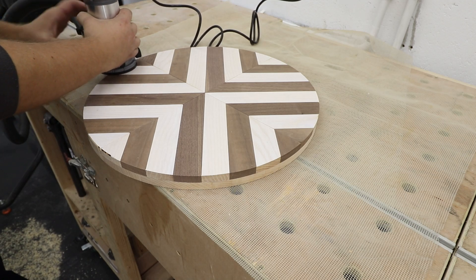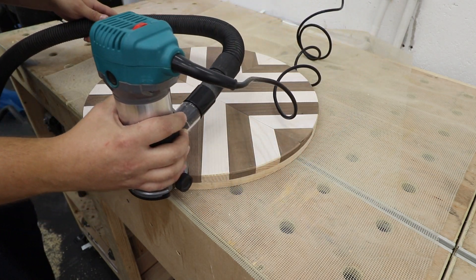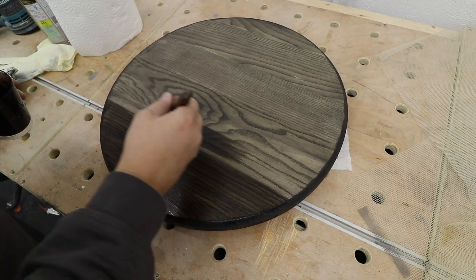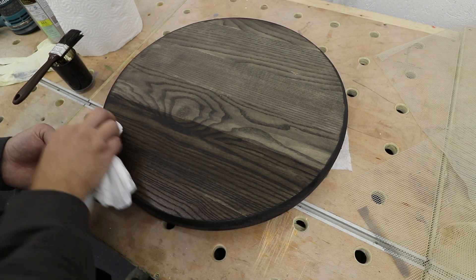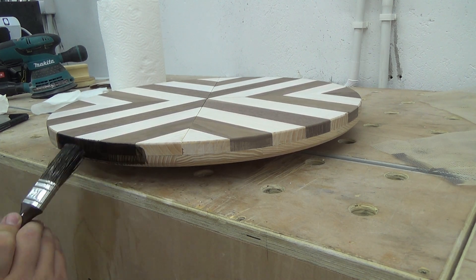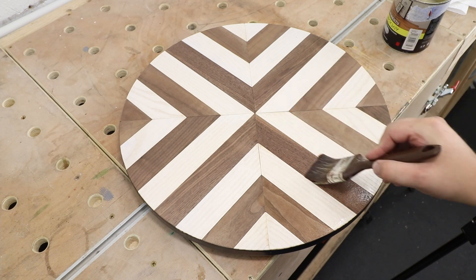On top of the tabletop I'm using a really tiny roundover bit — not much at all, just to get rid of the hard edge. On the bottom though I'm adding a chamfer to give it a really interesting and nice look. For the base and the edges of the tabletop, I'm applying the same wenge wood stain — more or less black — which I think gives a very interesting contrast with the white chevrons on top. I've already applied one coat of varnish on the top, denibbed it by hand, and now I'm putting on the second and final coat.